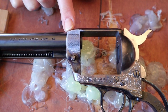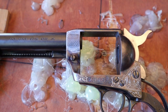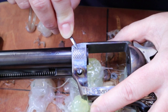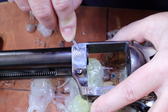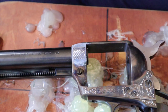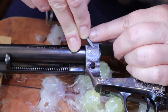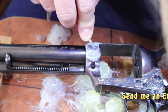Here is the drawing of the front strap — a checkered pattern that is quite popular with western engraving. It's relatively easy to cut; you just have to be able to do straight lines. I can see I'm struggling a bit, so that means sharpen, sharpen, sharpen. That's the rule of cutting case colored hardened, bone hardened metal — sharpen, sharpen, sharpen.